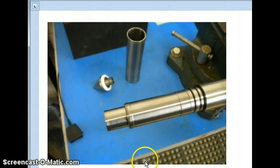Once the sleeve itself has been removed, you're looking at our new style sleeve gauging area. It actually entails a sleeve load cell separate from the tip load cell, and it's fully enclosed now for protection from the elements. Previous versions had the strain gauging right on the outside of the mandrill where it was prone to damage and prone to moisture. This package is far more stable and should provide you with much longer life.